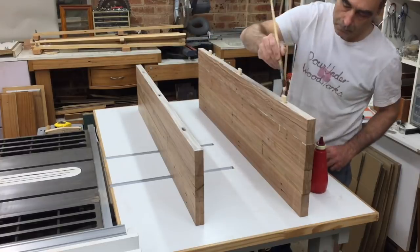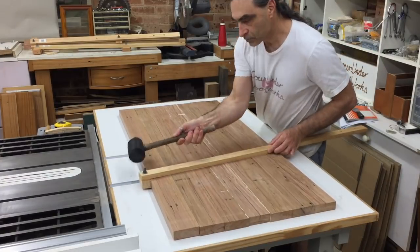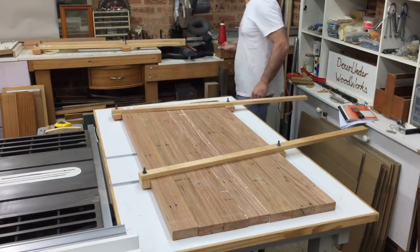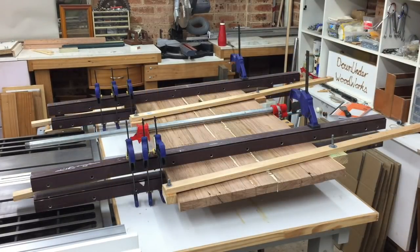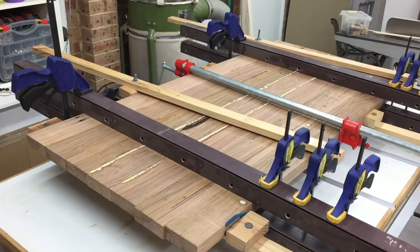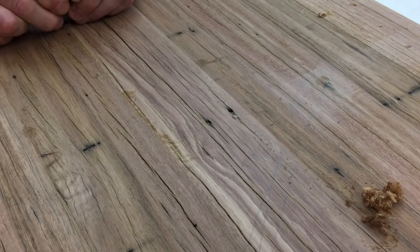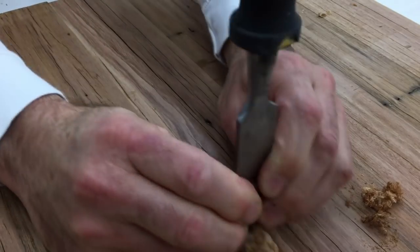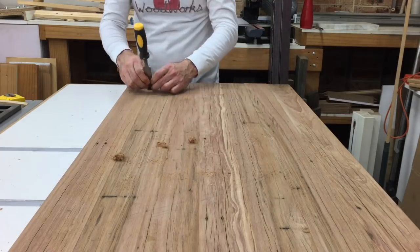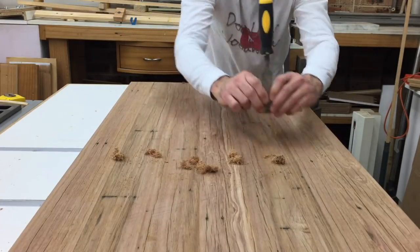I had a failure with my homemade double bar clamps so I couldn't use them — look out for an upcoming video about how I upgrade them to fix the problem. These quick and simple wedge clamps are great when you're stuck for clamps and work surprisingly well, as you can see from that even glue squeeze out. Once the glue was dry I removed most of the squeeze out with a chisel and then using that same chisel like a scraper I cleaned up all the glue lines. This works really well but it's very tiring on your hands, and I wouldn't use any of your good chisels to do it. And this was the finished product so far, still without any sanding.